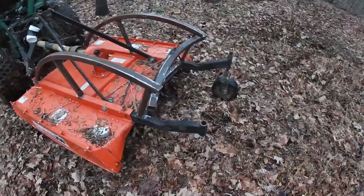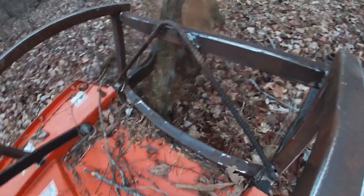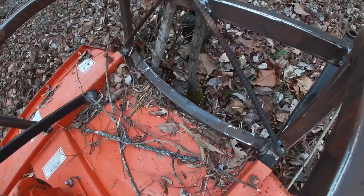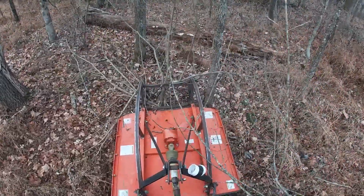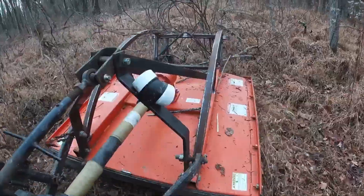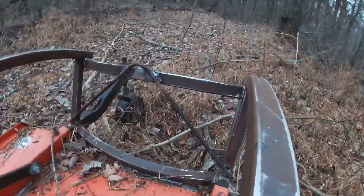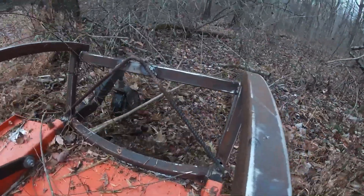So we'll go through the woods and do a little bit more cutting. It really worked pretty well — I'm pretty dang happy with the way it turned out and the performance so far. Time will be the ultimate test, but the whole goal is to keep from having to run over the trees to cut them down. There's nothing I can do on the end of the bush hog that's going to change the amount of horsepower coming out of that PTO — the PTO on that 755 is rated at 15 horsepower. But this makes it a more effective use of that horsepower: instead of cutting long ways through a bend by running over the tree, you're just cutting through the actual diameter of the tree itself. I've got a lot of this scrub brush and one and two inch trees on this property, and going around running over with the bush hog always ends up with stuff jammed up under the tractor in the cables and linkages. This is just going to be a really quick, effective way of doing it.